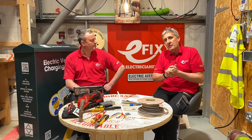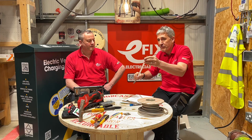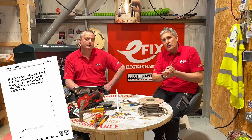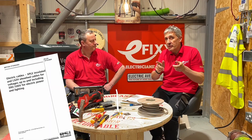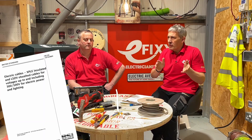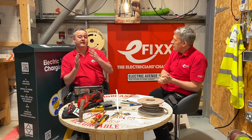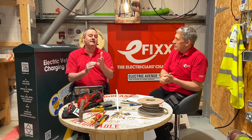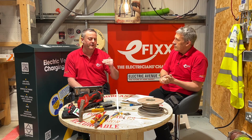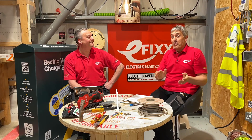BS6004 will be withdrawn next year — you'll only be able to use this new low smoke and fume cable with a fully insulated earth from then on. BS1271:2024 comes in on the 1st of April 2024. Scotland, as mentioned at the start, is taking a different route — it doesn't apply up there. They've gone for full mineral insulated cable in their domestic dwellings, removing low smoke altogether, which some people like to take to another level — especially at this time of year. Well, that's good news for those who thought the industry has been dumbed down. MI is back!